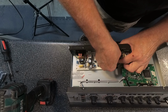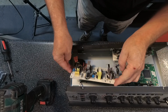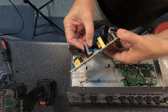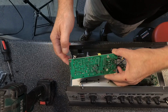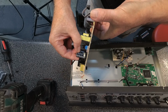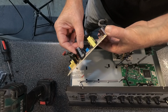Now we're going to disconnect the ribbon cable from the amplifier board. Disconnect the power leads. And we can turn this thing upside down. Now you can take a good look at that. It's pretty well gone. So one thing that I would caution anybody is that, see, this cap is a 100 microfarad 200 volt. So a couple of things, either it exceeded the voltage or defective cap.